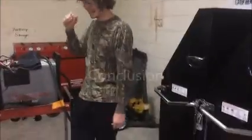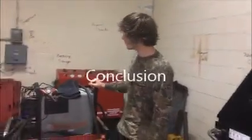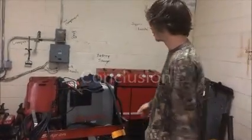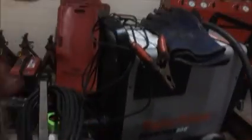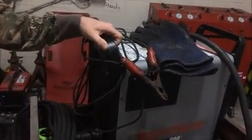Rough start, but we're still turning out pretty good. All in all, this is the plasma cutter — make sure you have all your safety gear: gloves, pants (which I'm not wearing). Make sure you have good ground, good air supply, good amp settings. Cut in a safe environment on a good table or tire like we did. Have your wire brush for clearing off your ground spot, and just have a general idea of knowing what you're doing and not blowing yourself up.